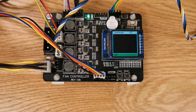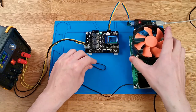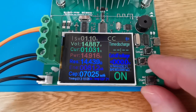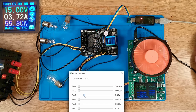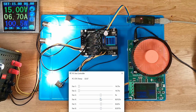Now it's time to test the board under load. I'll apply 15V through the power connector, power the digital part from USB through an isolator just to be safe. On the unregulated outputs I'll connect a simple electronic load at 40W. On the DC-DC outputs I'll connect car light bulbs, as usual, adding them gradually so each converter gets approximately 15W — giving us 100W total consumption.